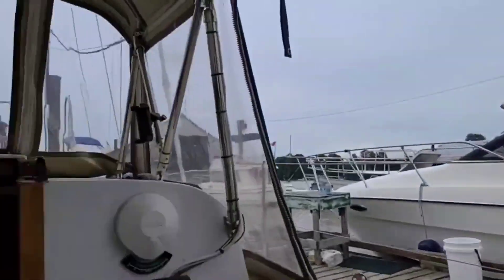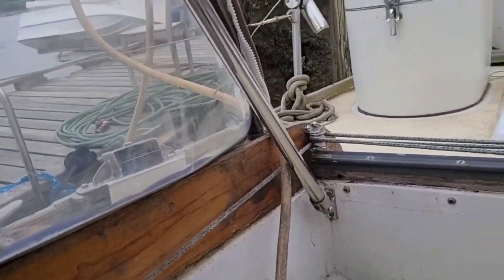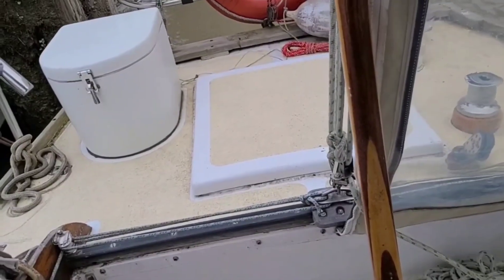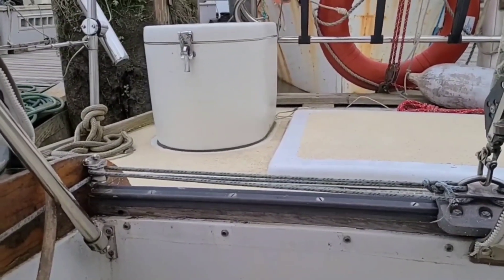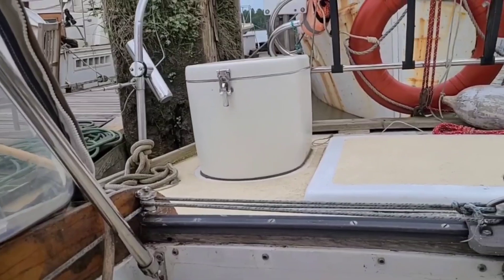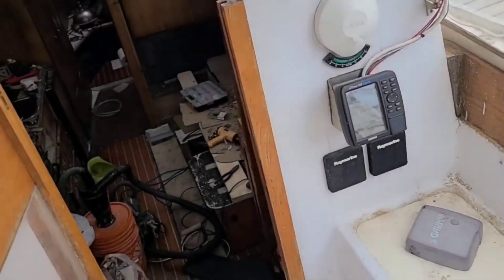Let's go forward first. Now backward — we are moving. It is pushing very well. I can feel some water — called the prop wash. I put the gear to reverse and the stern is going to the port side right away. I release my lines, go forward a little bit, then engage backward — the stern goes to the port side right away, but everything is fine.